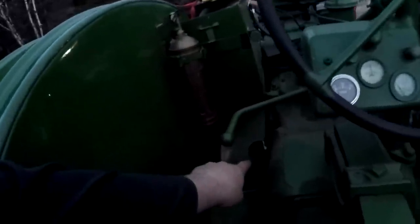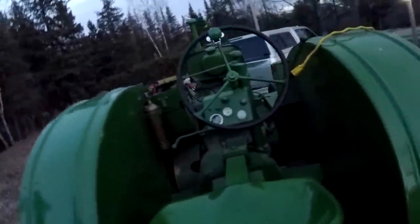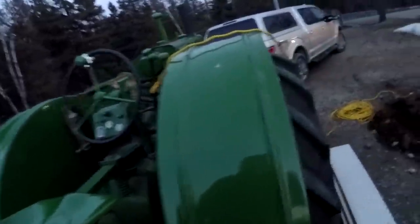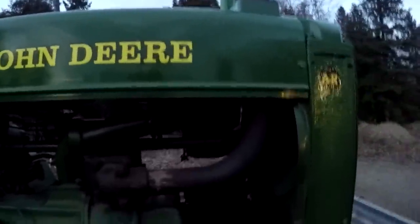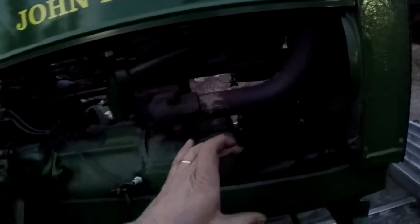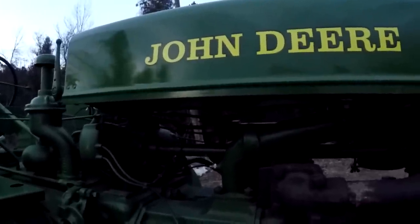But there's a band brake, I think, under this cover. And it just pulls on the band, and that's your brakes. That's your brake system. It's pretty simple, nice, easy to work on. So we might have to replace them because they didn't feel that great. Or maybe it just needs adjusted or something. I don't know. But anyways, I showed you this side a bit. Great big radiator in it, and a huge hose, like a 3-inch hose anyways, feeding it. So that's pretty cool. Now, the thing I don't understand is...